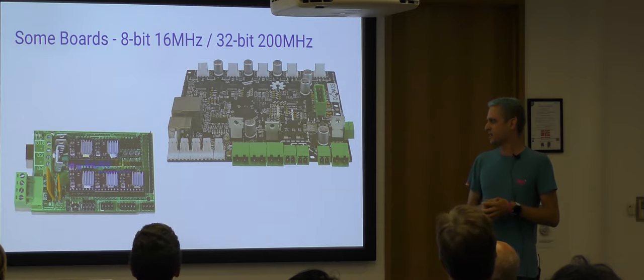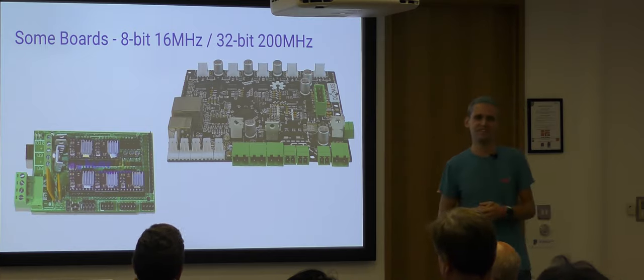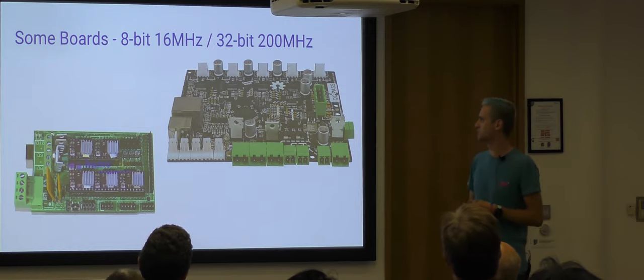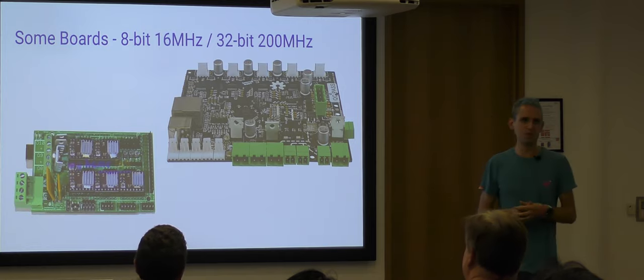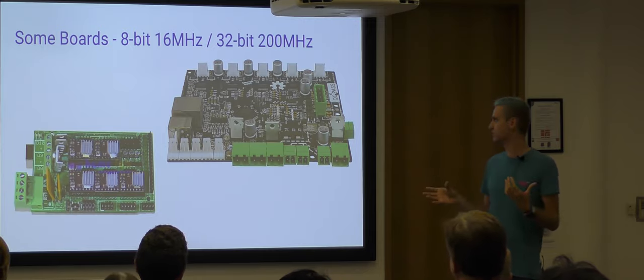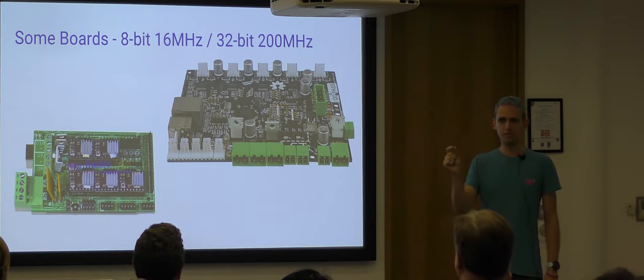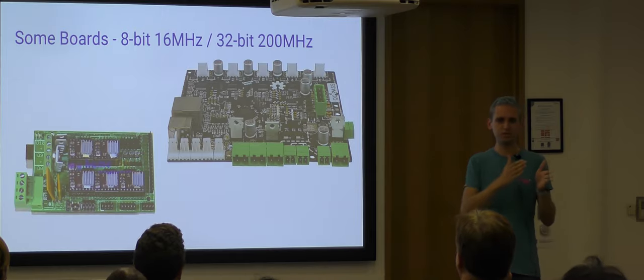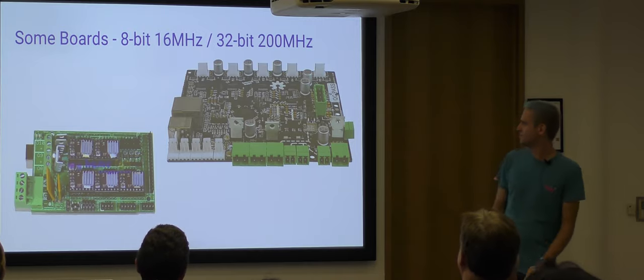As I said, it's pushing the limit running a Delta off an 8-bit Arduino. So a better option, which I haven't gone for yet, is to pick up one of the new 32-bit boards. So that's a Smoothie board there. They produce, as the name implies, much smoother movement. So you don't end up with the machine occasionally just stopping as it's buffering new instructions for where it's going to move to. You can use finer grain delta segments, which is the name for what it breaks your movements into. And then that produces much smoother finishes on your prints.